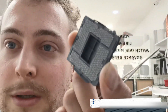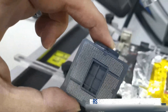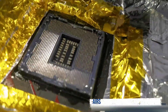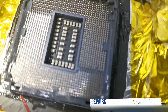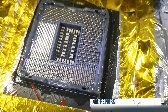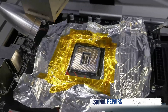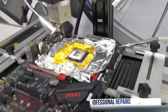We've prepared the board — here's the new socket. As you can see, here's the brand new socket. Flip it over — as you can see it's already pre-balled, we've added all the tape. Looking carefully at the actual socket, we can see that one pin is actually completely broken on the left-hand side. Unfortunately this is a connect pin, so we've already prepared the board with heat tape and we need to remove the socket.